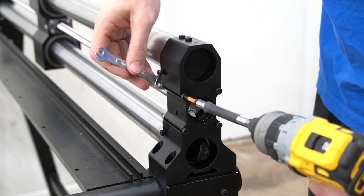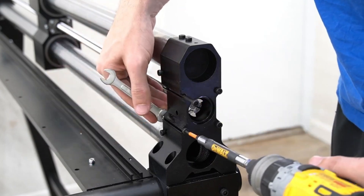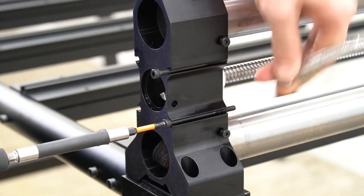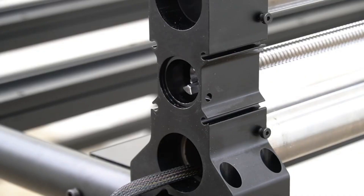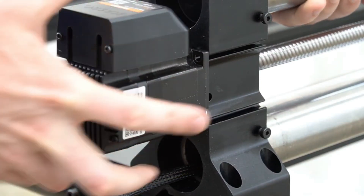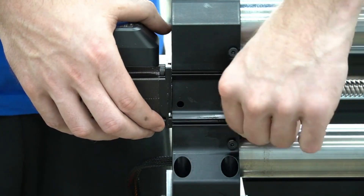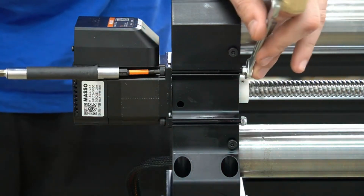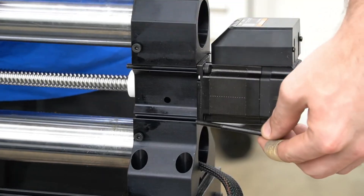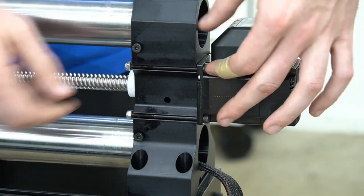Now that we have our X-rail assembled, we'll move on to the B axis. Here we're removing the bolts with a four millimeter hex key and an eight millimeter crescent wrench. On the B rail, all bolts are the exact same size since there is no drag chain. With all of those bolts removed, we can now mount the motor to the end of the rail. We're going to line up the red bushing coupler on the motor with the existing half of the coupler already mounted to the end of the ball screw. Once we have that in place, we'll reinstall our bolts and tighten those with our four millimeter hex key and eight millimeter crescent wrench. On the opposite side of the B axis, we're just reinstalling our bolts, getting the nuts hand tight, then tightening with a four millimeter hex key and an eight millimeter crescent wrench.